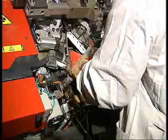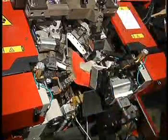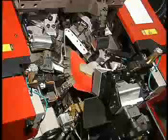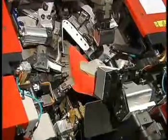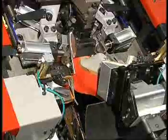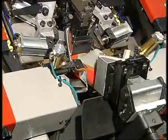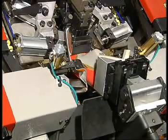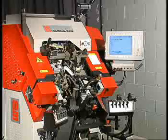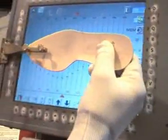Sincron Zero ensures cementing is impeccable even on very pointy or unevenly shaped toes. Cementing is precise and reliable even with a soft insole or on very thin and tapered lasts. The path taken by the nozzles can be set intuitively by following the profile of the insole.